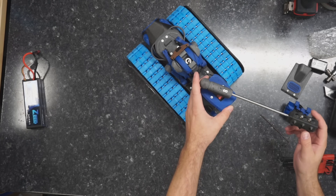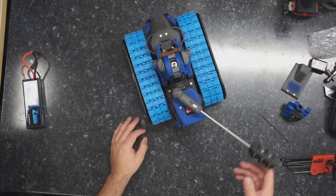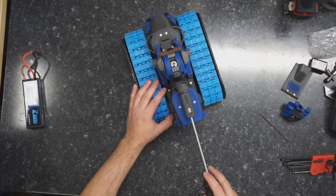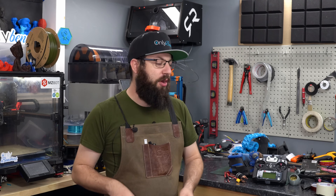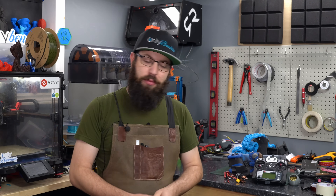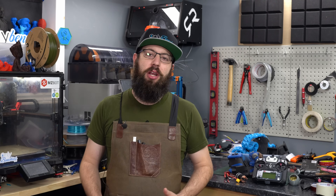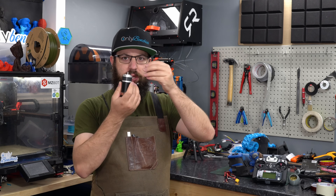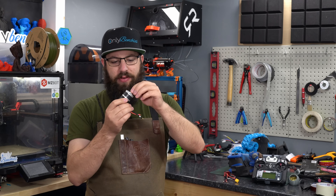The basher arm — the servo arm — is completely dead. As you can see, the servo is just flopping in the breeze; it's got nothing left to it. I did flip my robot a few times and tried righting myself with the servo arm to see if it had enough force to flip me back over. I don't know if that's what eventually killed it, but the servo arm is toast. The biggest issue I've seen during the teardown was the drive gears. On the Lisu planetary gear, there is a little bit of play on the drive shaft now.